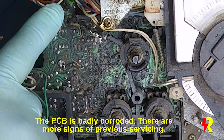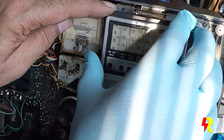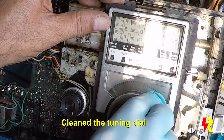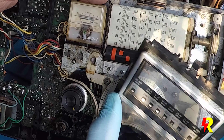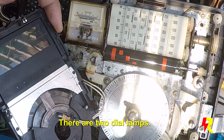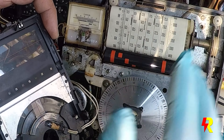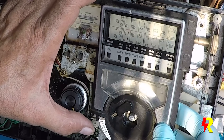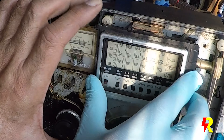So what I will do is clean it all up first. I have been trying to clean the dial — it was full of grime and dirt. It's very easy to remove; there's a little latch over here and this can be easily removed. There's a dial lamp inside. Basically there are two dial lamps taking about 40 milliamperes each. I've cleaned this with isopropyl and it's fairly good. So I'm going to fit this back.